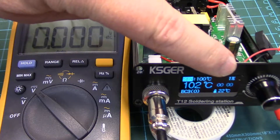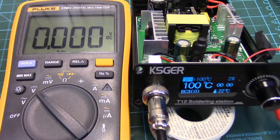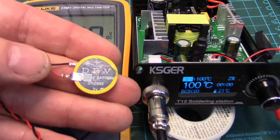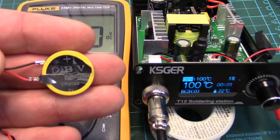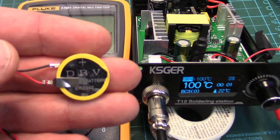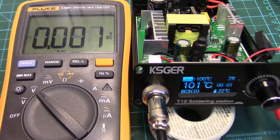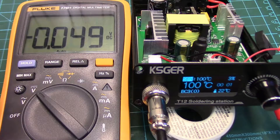There is a clock on this thing — a funny feature for a soldering station — but it's got one. When you turn it off, or at least on mine, it resets to zero hundred hours every time you power it back up. The reason for that is there's a little backup battery in it to keep the time when it's turned off. It's just a standard 2032 lithium 3-volt button cell, and this thing is completely dead. I'll just probe it here — in fact, it's reading a little bit of negative voltage. It's stone cold dead.